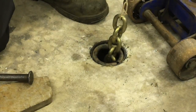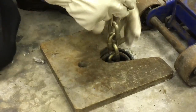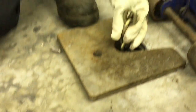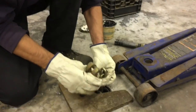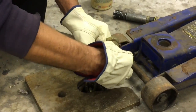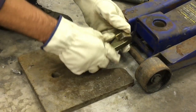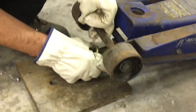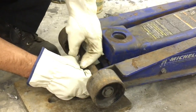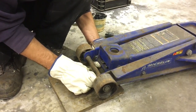This is the whole key to installing the anchor pot. This plate holds the outer part in place. This is a claw hook, also available from autobodytoolmart. We hook that in there. We're going to take our jack and hook it on there like so. Our assistant is going to start jacking the jack up to get some slack out of it.